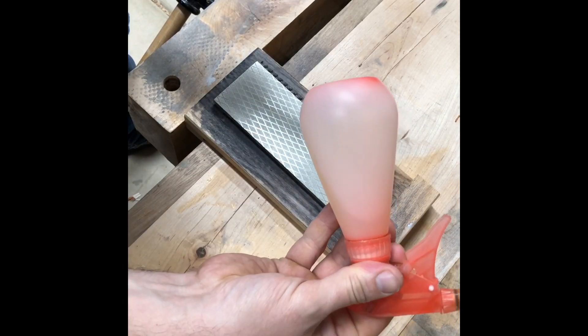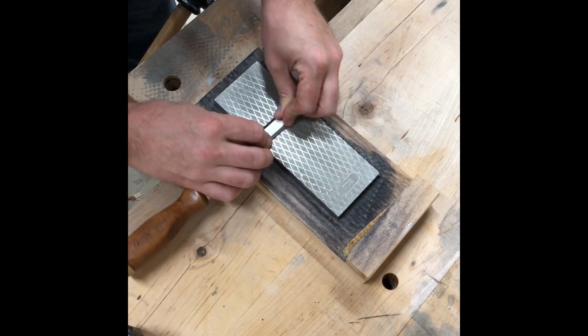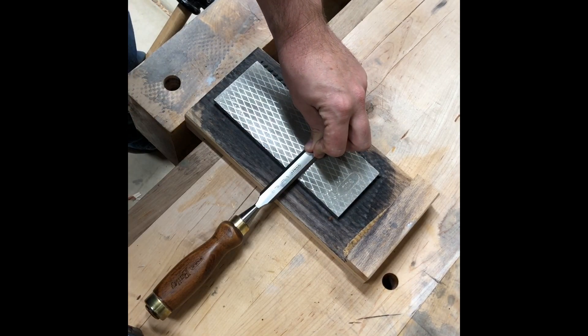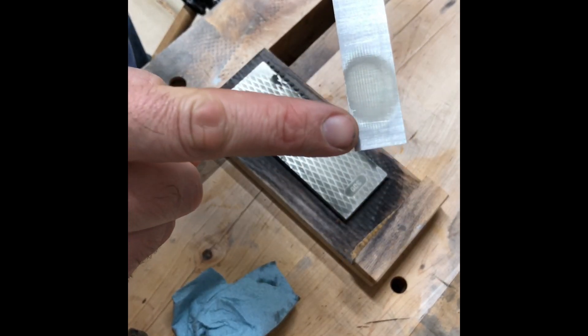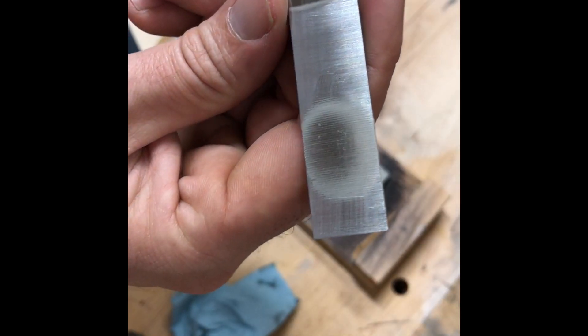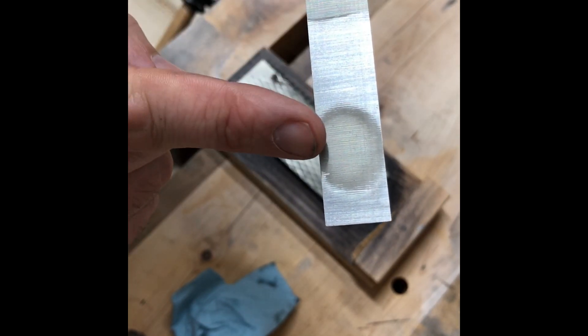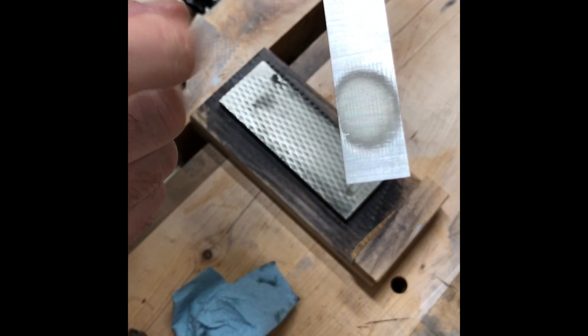So we've got a little spray bottle here. Just wet down the stone a little bit — it doesn't need much. We're going to run this back and forth a few thousand times, so let me fast forward. As you can see, we're already starting to flatten on the two ends. There's obviously a belly in the steel itself. I'm flattening it all the way back. As we move up, we should see that removed, and once we get an even surface, we'll switch up to the thousand.